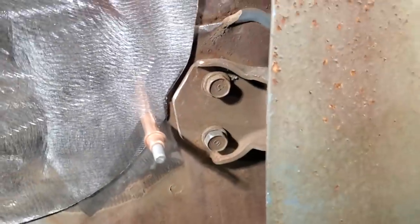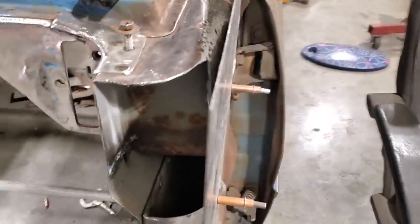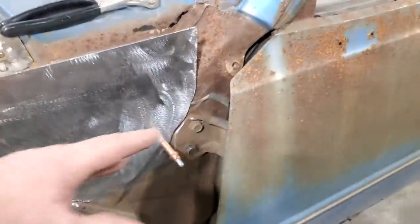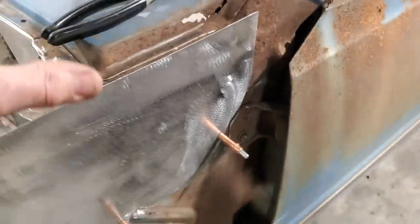And you can see here, it fits around the hinge and around the bead. And I went and put two clecos in it. This overlaps this panel a good bit, as you can see over here. See how much it overlaps, okay? Now that I got that fit in place and I'm happy with this section here, if you look in here, it's a bit longer, okay? I'll have to trim that up after the fact, same as before. It'll make it too big.